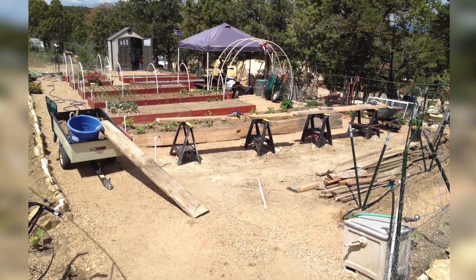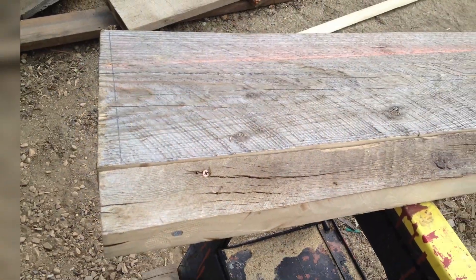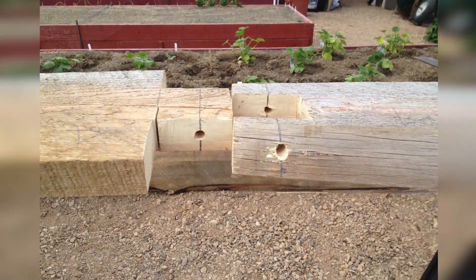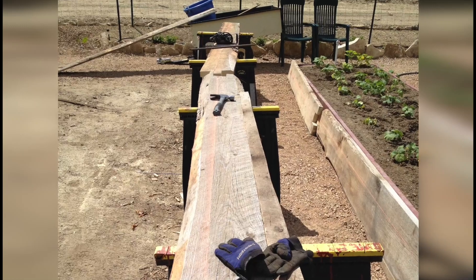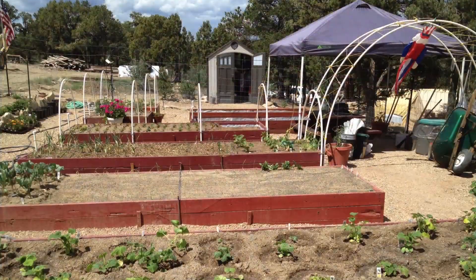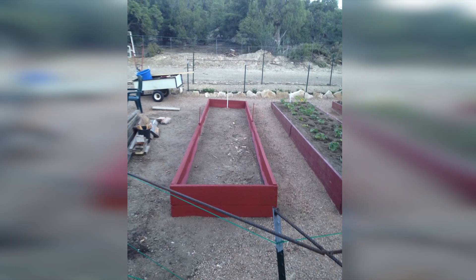We're making the last box now and I'm going to show you in more depth what I went through to build these boxes. I got these planks from a local lumberyard — this was before I built my sawmill. I had to square them up, get them ready, and make some square notches to join them together, because this one is 25 feet long and they didn't have planks that long. So I did the joining, drilled some holes through them, set them up, and pounded rebar — three feet of rebar down through each one so it went down into the ground right where it hit the rock. That's how I secured them so they wouldn't move.